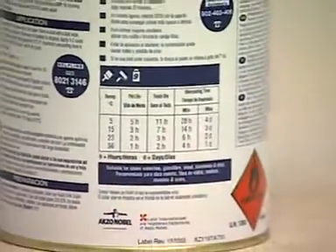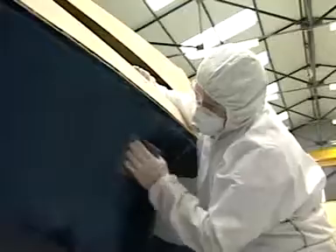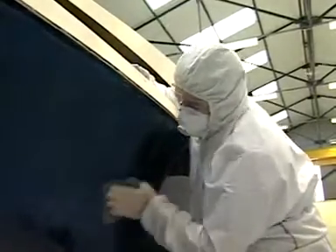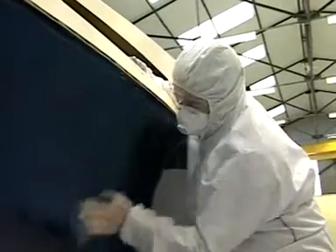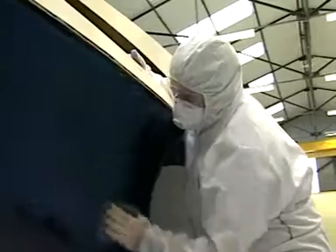When you have finished the first coat, leave it to dry overnight. Consult the product label for the minimum overcoating times as these are temperature dependent. When it is ready to overcoat, remove any imperfections like sags or dirt using 400 grade sandpaper. Then lightly sand the entire surface with the 400 grade paper. Remove all traces of dust using tack rags as before.